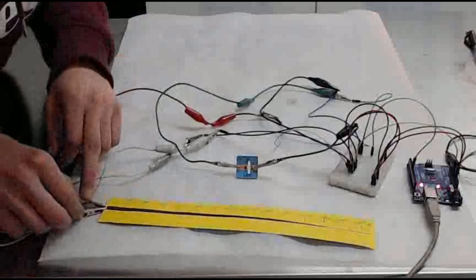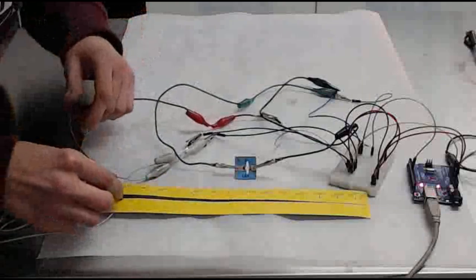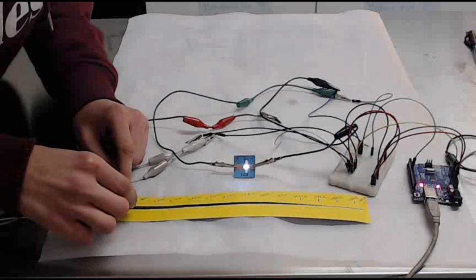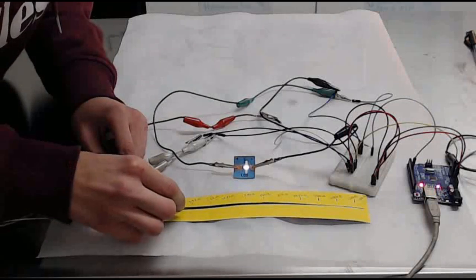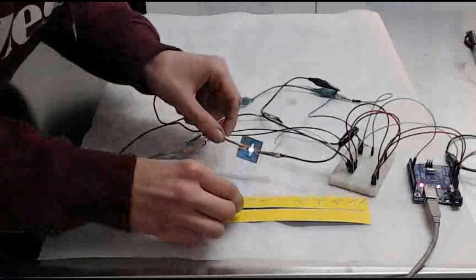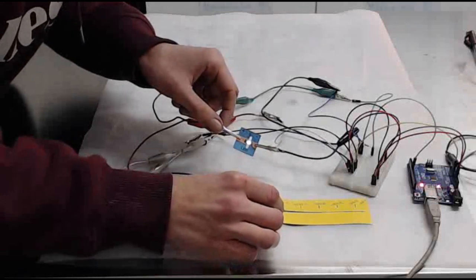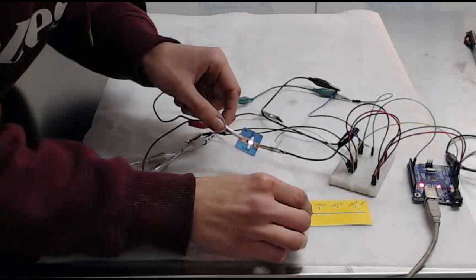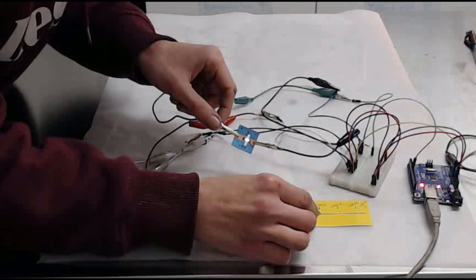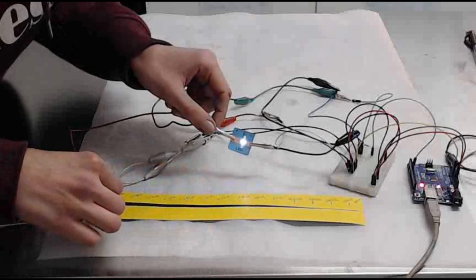You have to be really careful because if anything touches it will end up shorting the circuit. So now if I touch this, the LED will come on. The further I run my patch cable down this stream, the dimmer it gets. I'm now hitting about 31 kilo ohms and we're at about this much brightness. We keep going down and we hit about 75 kilo ohms, and it's at that point where it's almost about to turn off. Bringing it all the way back up, you see the brightness just increased.